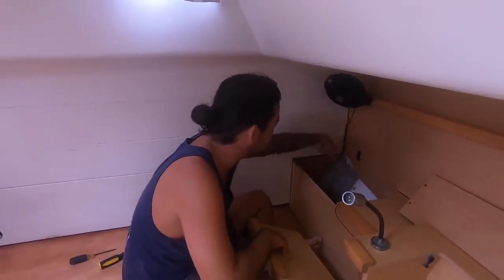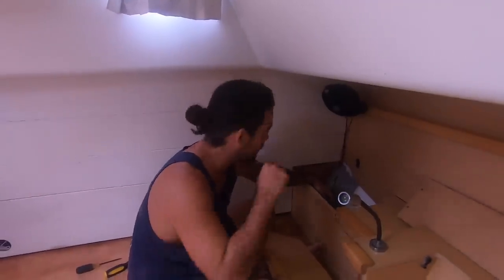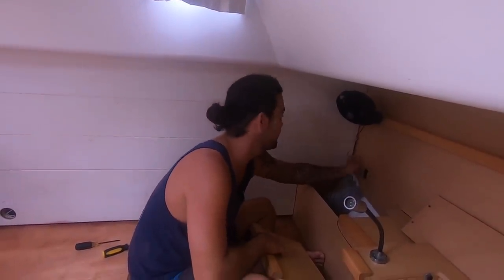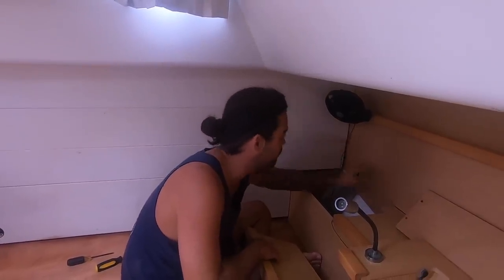This piece we had to cut out to redo the tabbing — this is all new epoxy tabbing on the front side of the engine room. We're in the starboard aft cabin. Now that it's all glassed back in and glassed into the front side of this engine room bulkhead, it's super, super strong again.